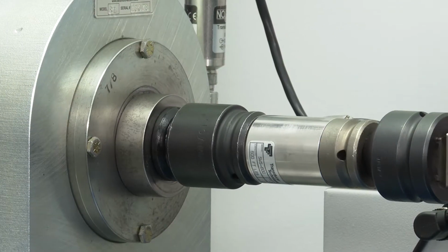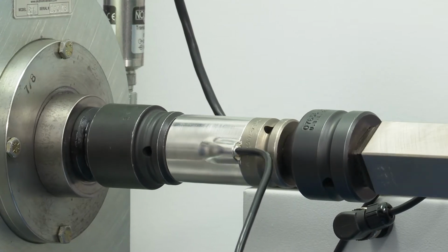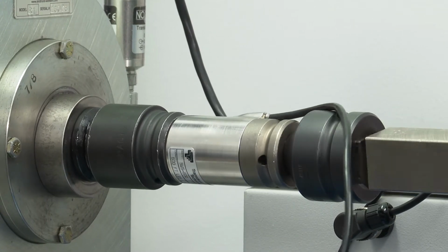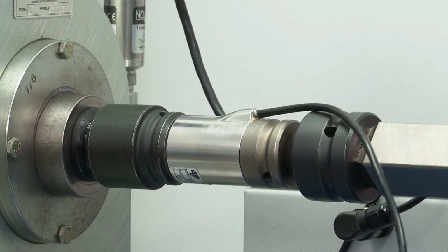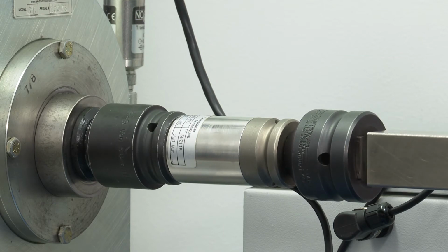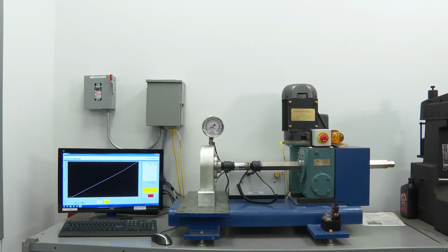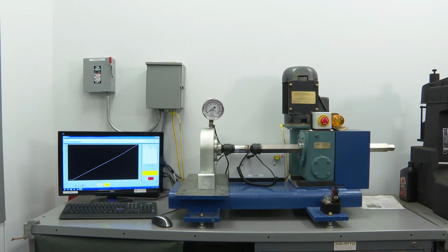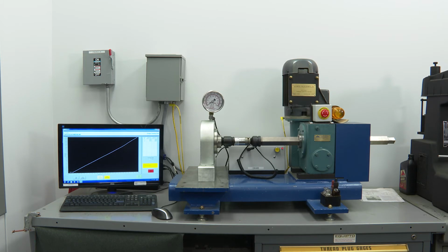The force is applied to the nut continuously from start through final torque using a rotational speed of approximately 10 RPM. Each nut and stud assembly should be used for a series of 10 rundowns. The nut should be loosened to zero tension within 10 seconds after attaching final torque on each section of the test. A 5-minute cool-down period takes place between each section of the test. This starts after the nut is loosened to zero stud tension.